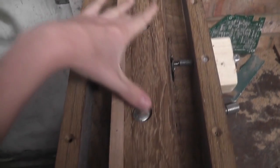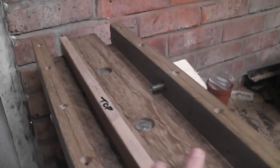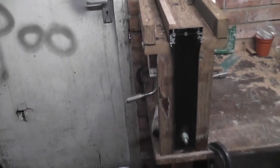The second part of the jig is that the top table is bolted down through the main support into a piece of wood. Now, this block of wood would be freely swinging, and you can see the 2 bolts at the bottom that hold it to the top table, if it weren't for the 2 bolts coming through the side, which are connected on this fixed piece of wood here, so that when you tighten or loosen these bolts, it clamps it against the piece of wood and forces the top table to move sideways.